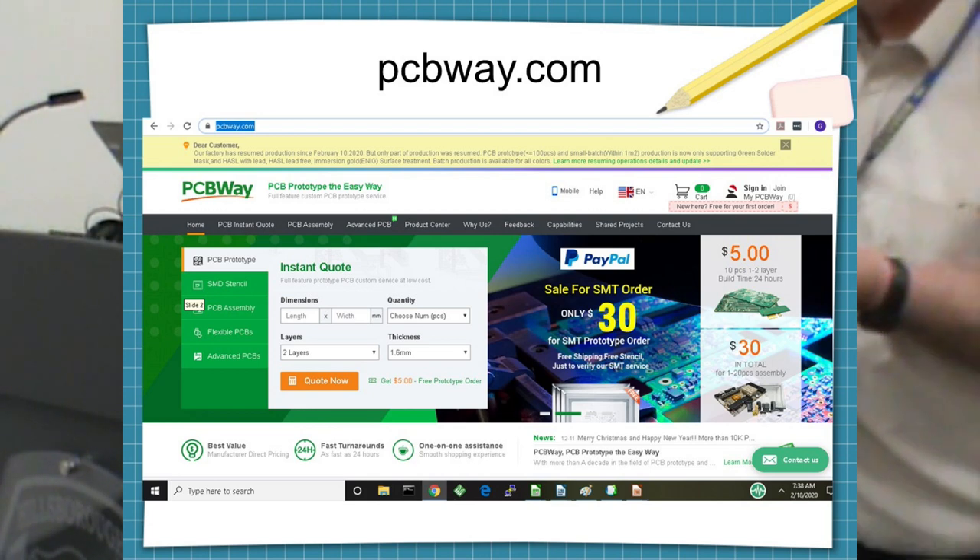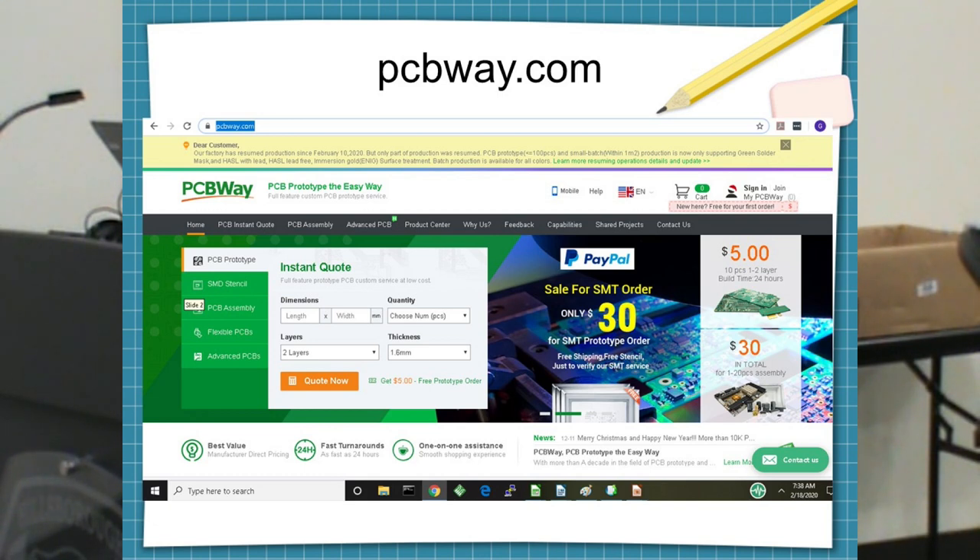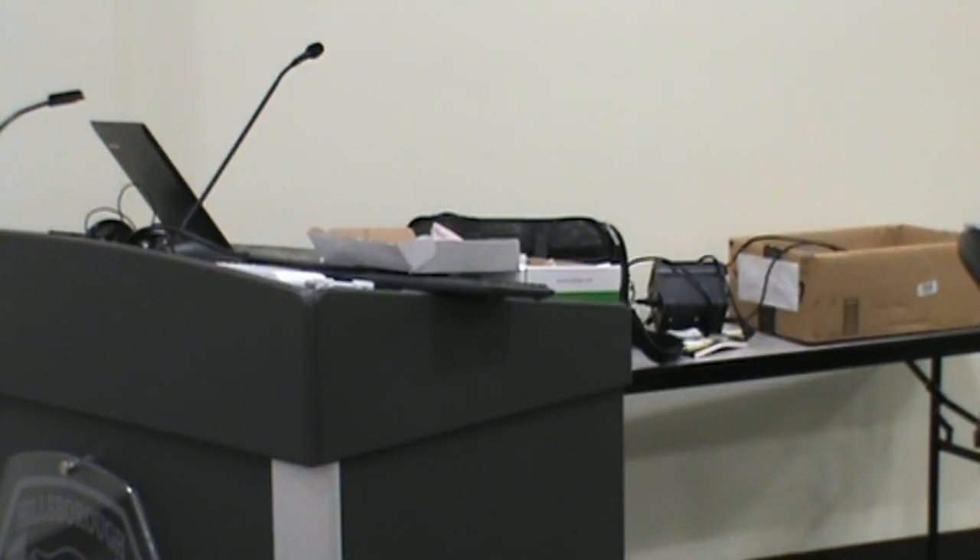Here's another board I did — a wild board intended for multiple purposes. It's a smart battery charger, recycler, and tester for batteries. I can do any kind of battery — lithium, whatever. I also left the gizmo on it that can control the SI5351, so I can use this as a variable VFO if I need it. It can be a VFO or a battery charger or whatever I need — all it is is solder pads, and what you do with them is up to you.